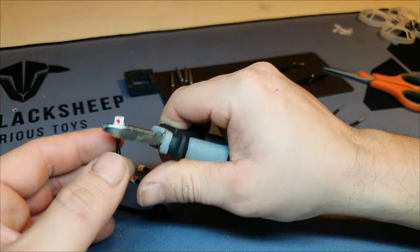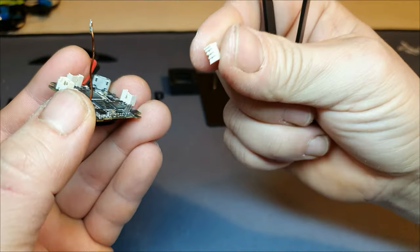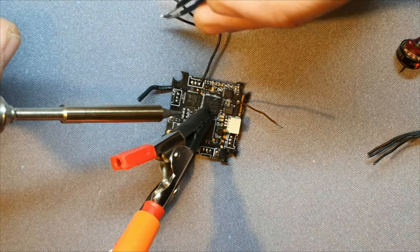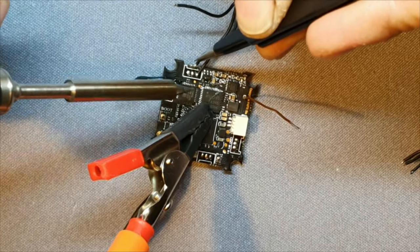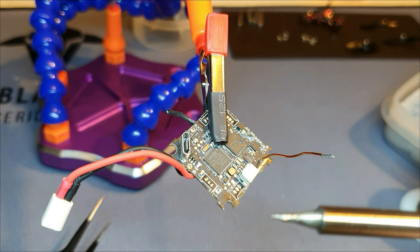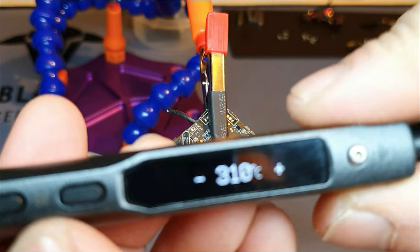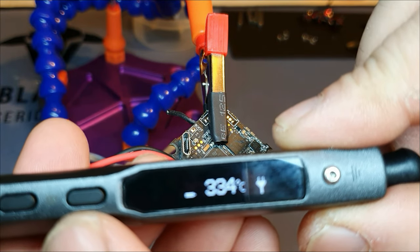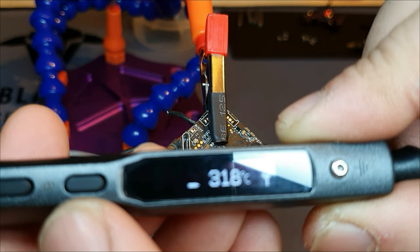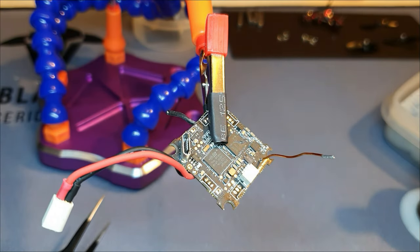So I can finally shed my last bit of weight. I'm going to cut off the connectors from the motors, remove the plugs from the all-in-one board, and direct solder the motors to it. Disclaimer: these boards are very small and have a lot of electrical components that are very close to each other, so there's a chance of damaging components. When you solder to these all-in-one boards, set your temperature lower if you can and use a very small tip. I use the TS-100 with temperatures set to 300 or 310 degrees max, and don't rest your iron on the board.